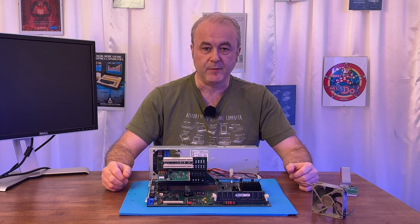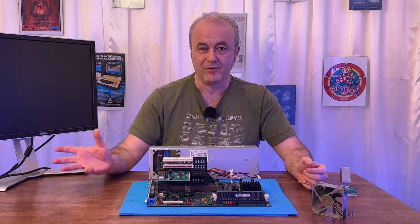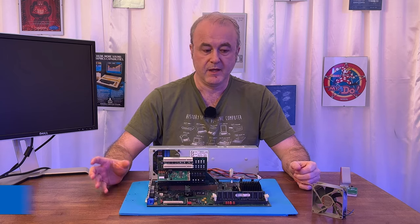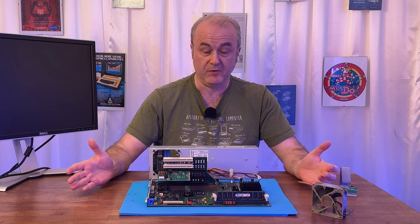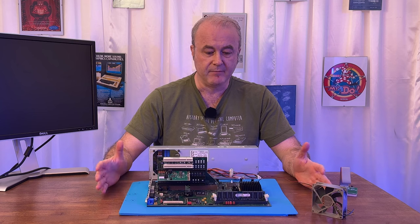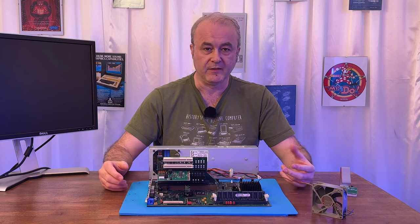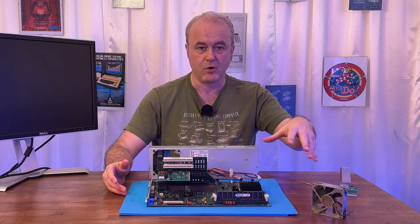So if you look in the manual for this machine, code 61 says, I'm paraphrasing here, decompressing the BIOS. And that's it. So it was decompressing the BIOS. I didn't really know what that meant. Previously, I've only really worked with Amigas. On Amigas, there's no decompression of the BIOS. In those cases, those machines have ROMs.